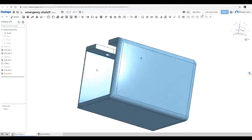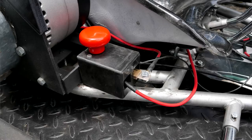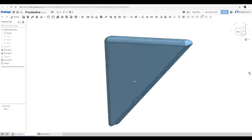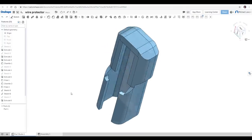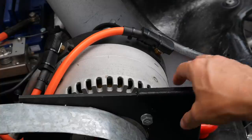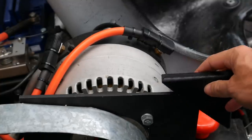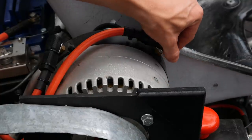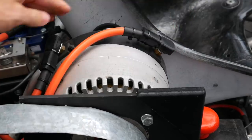Some of the main electronics are housed inside a 3D printed box designed in Onshape, printed on the school's Prusa i3 MK3 printer. These next two parts show a good understanding of the 3D printing process and are designed to be printed in flexibles. The triangular piece is a guard to protect the user from hitting their elbow on a sharp edge, and the second piece covers the battery terminals to avoid any chance of the user damaging themselves or the motor.